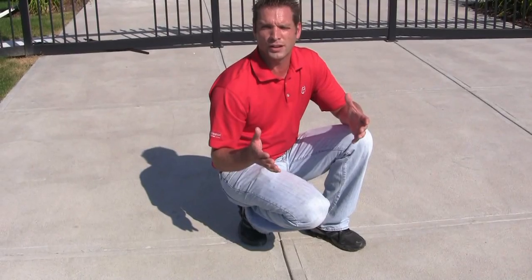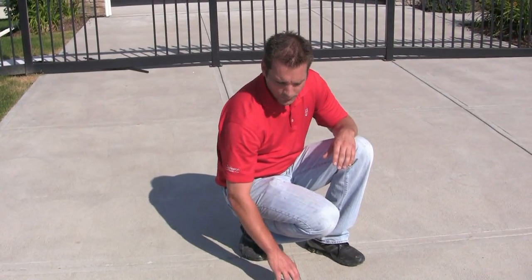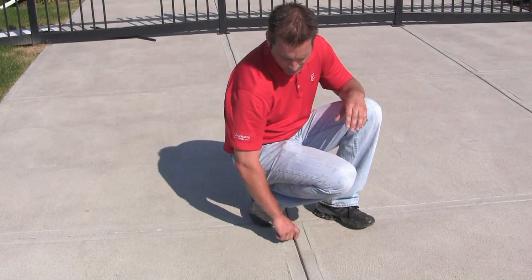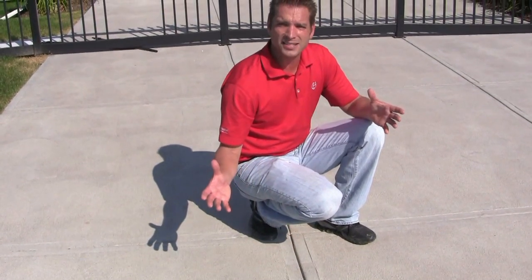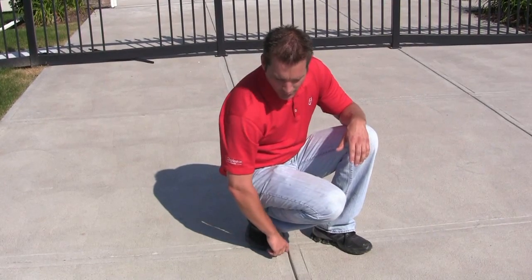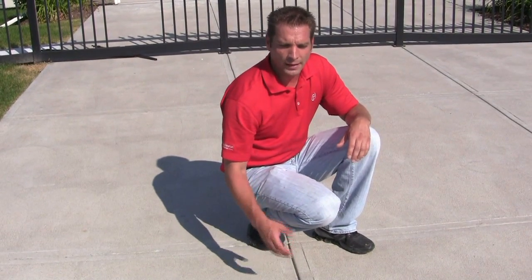Concrete shrinks up to a quarter of an inch in ten feet as it cures. To protect these cracks, once they crack through down to the bottom — which you can see these are already cracked, though you might not be able to see on film — you want to prevent that ice and snow mixture from penetrating down in there, because the freeze-thaw action is what can damage the surface of your exterior concrete. You can use a concrete crack filler material or a caulk-style product to fill in these joints, which will help prevent any moisture from seeping down into the cracks and prolong the life of your exterior concrete for many years to come.